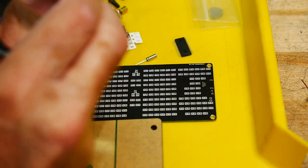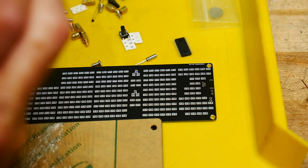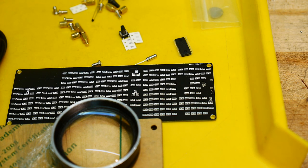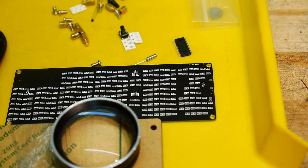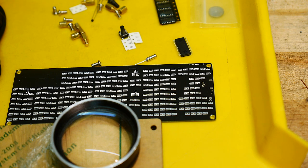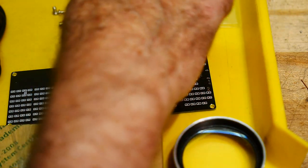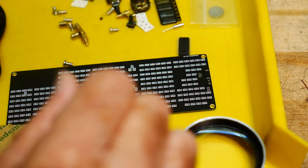Let me get out the magnifying glass. Let me put it under the microscope. They are — yep, 595s. Shift registers. I love those things. So we have six of those. Six times eight — that's a lot. Those probably drive... there's a crystal, capacitors, battery holder. This IC is not so bad. The pins are really bent, except for one, maybe two. Not too bad.